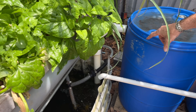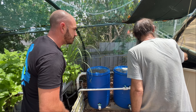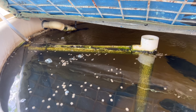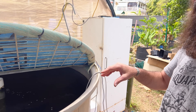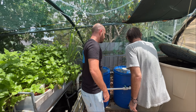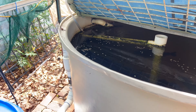We have a hose that goes down out the side of the sump tank, runs around the back, and enters into the fish tank. Over the back I have a water inlet with a venturi to help supply oxygen to the fish. The fish do their business in there, and any solids and water are picked up at the bottom by the solids lifting outlet, which collects the waste and ammonia, and is taken out through the side wall of the tank into a drain line.